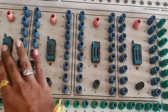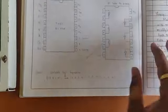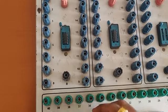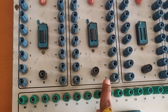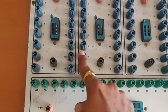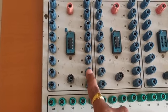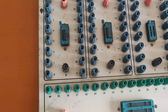There should be a connection between these two ICs. The 74151 is a 16-pin IC, so all pins are taken into consideration. But for the 7404, pins 8 and 9 are disconnected — we don't take those two into consideration because the 7404 is a 14-pin IC. For the 16-pin IC, pins 1 through 16 are all used. For the 14-pin IC, pins 8 and 9 are neglected.